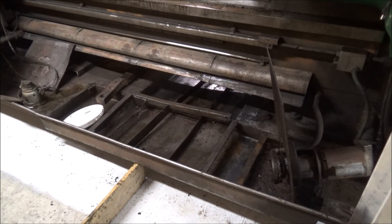I've got it mostly cleared out — there's the mess. I've got it straightened out, but I've got a bunch of broken braces and bench stuff. It's nowhere close to level. I've got to try and get this thing pounded down and straightened out so I can go in there and weld those braces back and maybe get this thing halfway close to like it should be and back to where it'll hold coolant again. As a big machine, the coolant will be pretty much a must-have on it taking heavy cuts — it'll do a whole lot better, and it does a decent job of helping keep things from rusting if you use good coolant running on everything. So I'll get the jack back over here and start pressing on this thing, guessing the highest spots, and work my way down.